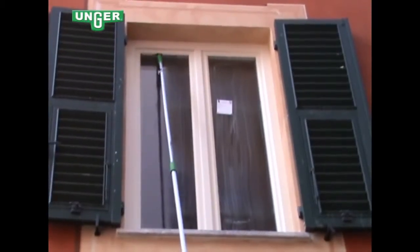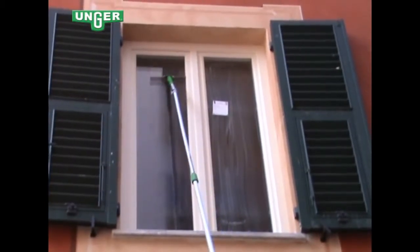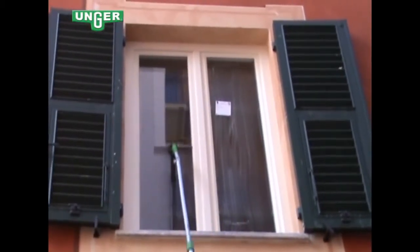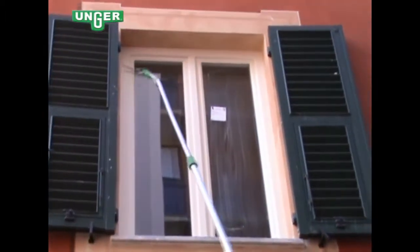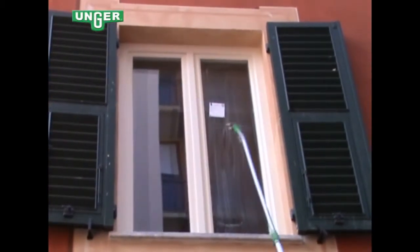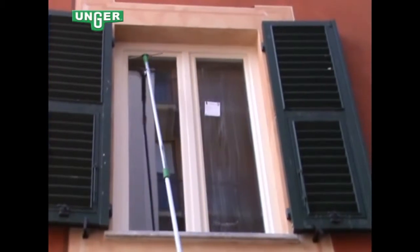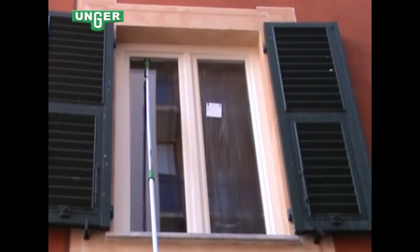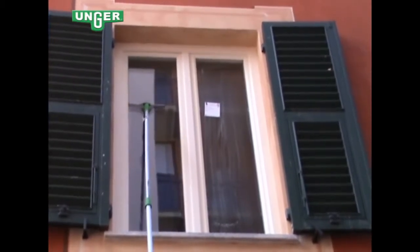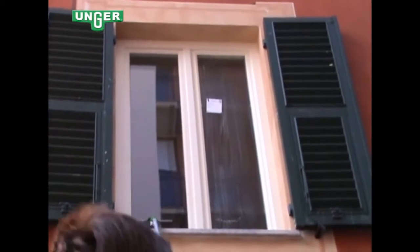On narrow windows like this one, choose a blade size which is just over half the width of the window. Squeegees work best if the window is wet. Pulling the squeegee on a dry window is likely to leave streaks, so if you use a squeegee that is too long, you will only have a couple of inches width of remaining solution and the rest a dry window. Notice that both pulls of the squeegee were slightly diagonal, being inclined towards the centre of the window.